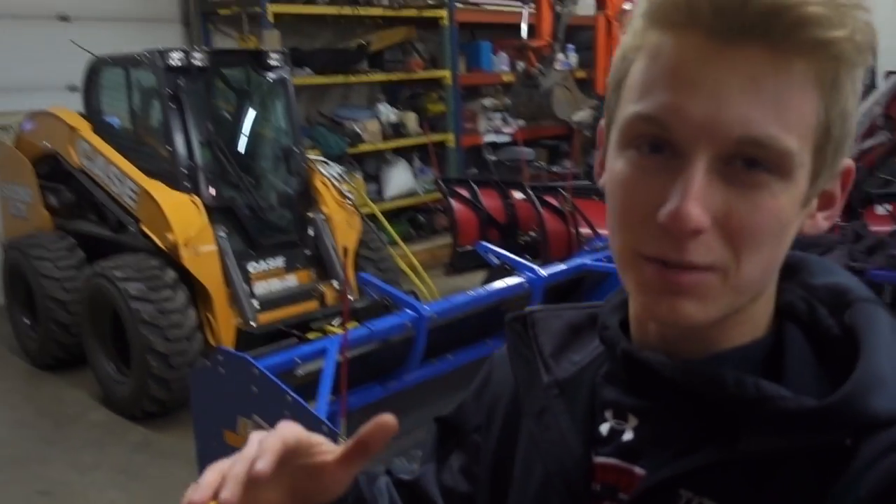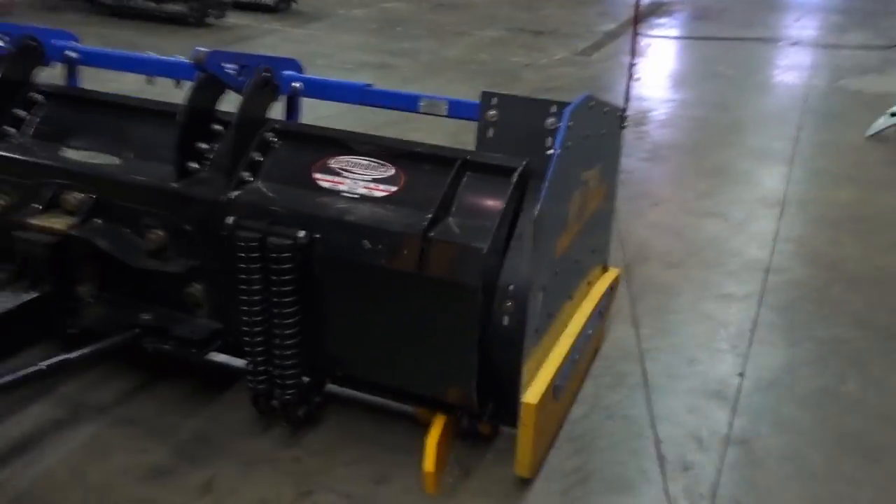This is not a sponsored video — they sent me these to put on and make a video about, but I'm not paid in any way to do this. I just want to give you my totally honest opinion. At first I thought they were maybe a little gimmicky — they don't look that big, they don't look that heavy duty. But after installing them and going on their website and learning they're good for curbs like we just showed you, I'm telling you, this thing is great. With the state contracts and asphalt curbs — if he wrecks an asphalt curb he's responsible for fixing it in the spring. That's what a lot of state contracts are: super picky, super tedious. If you guys want to get into big commercial snow plowing, having these on there is going to help big time near asphalt curbs, do way less damage, and keep things a lot cleaner.